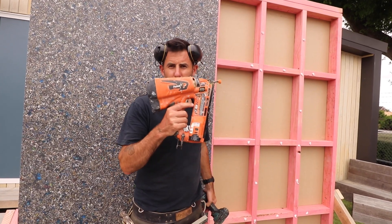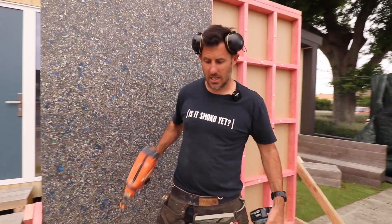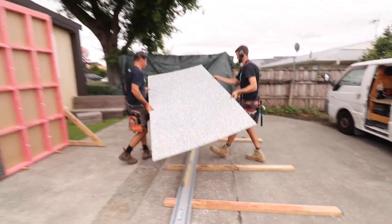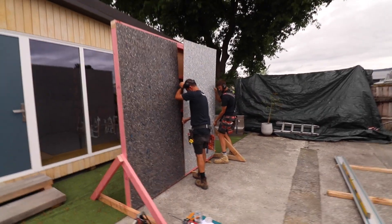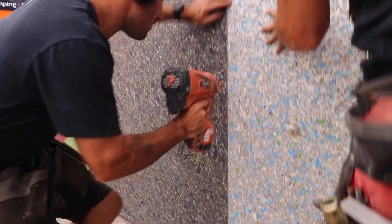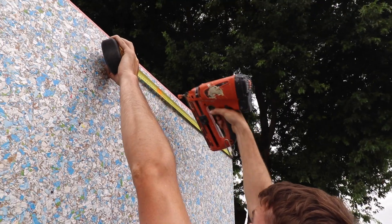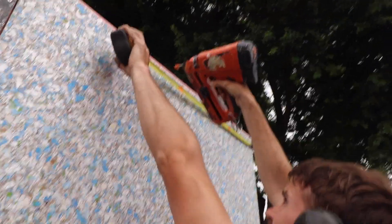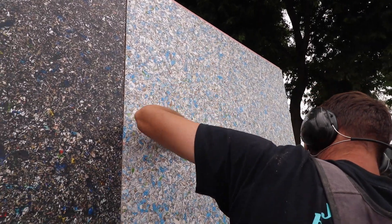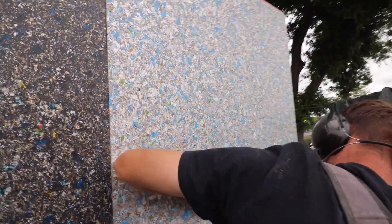This board here we're going to brad with panel pins, assuming it's a non-braced wall — a little bit faster, a little bit easier. To make sure your pins are all hit home, slowly rub your hand over the final product, giving them a gentle tap, and then let the glue do its magic.